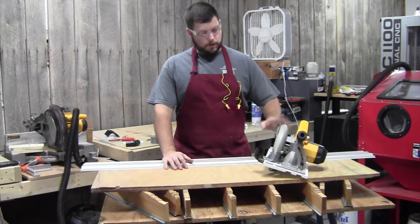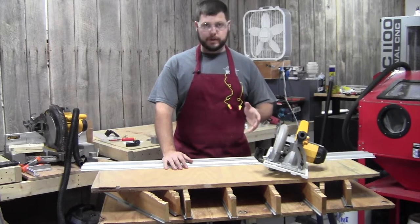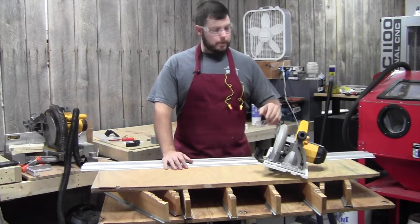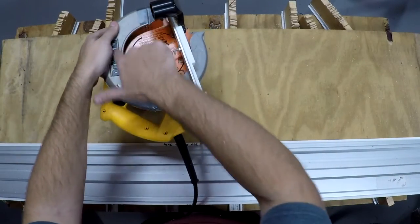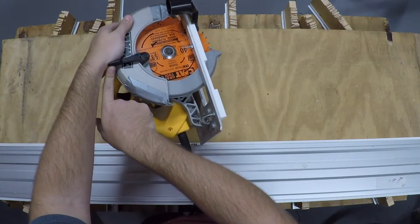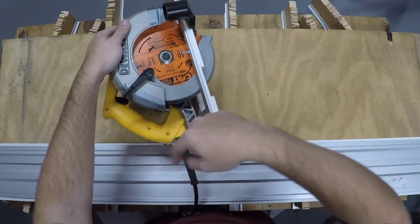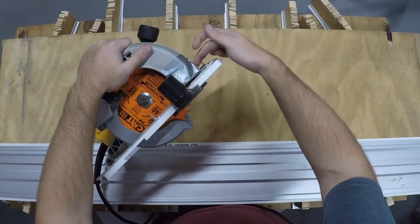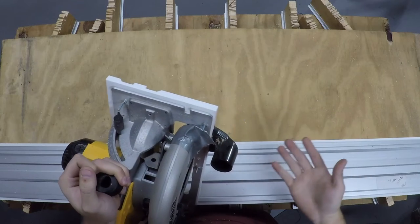What I've done with this saw is I got a little creative with some duct tape. Sounds kind of hokey — the engineer in me hates it, but the guy that was born on a farm is pretty okay with it. Basically, what I did here is I took and covered the rear exit on the top saw guard, the one that didn't move — basically just covered that hole where the sawdust usually shoots out. And then on the front of the blade, where there's usually a big giant opening, I went through and just wrapped some duct tape around and molded it to the saw guard.